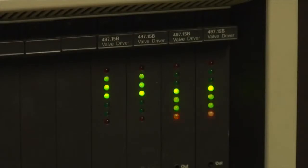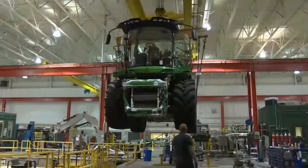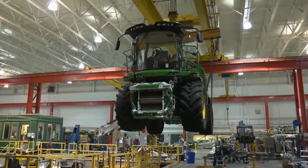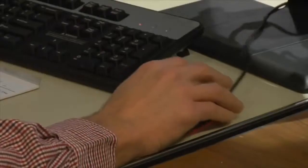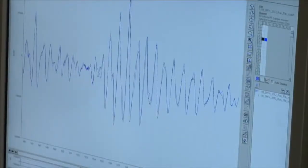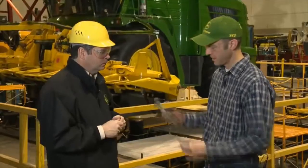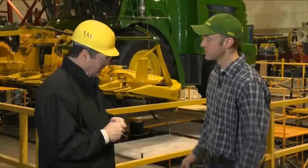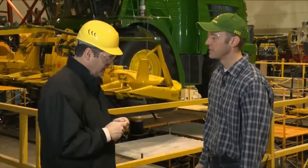When one set of tests had finished, the machine was reset. Bet you've never seen a forager fly. So we're looking for the structural integrity of all the structures on the machine — broken parts, cracked welds, buckled parts, loose bolts, broken bolts. And we've had one significant failure. This particular bolt right here retains the cutter head pivot casting. So it's the main retention bolt for the cutter head on one side of the machine, and it failed.